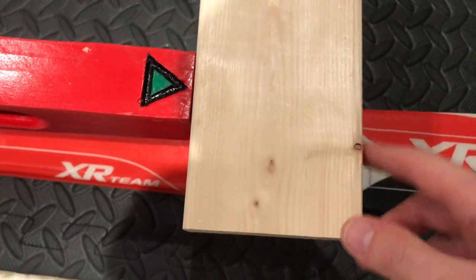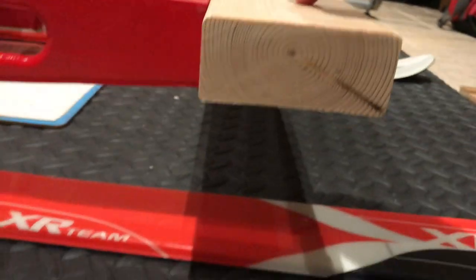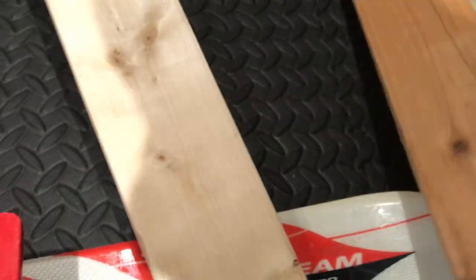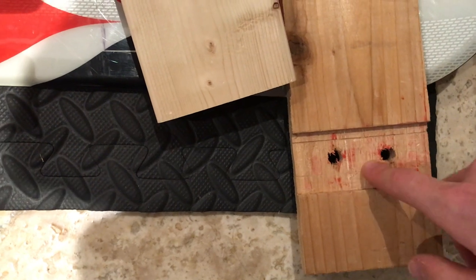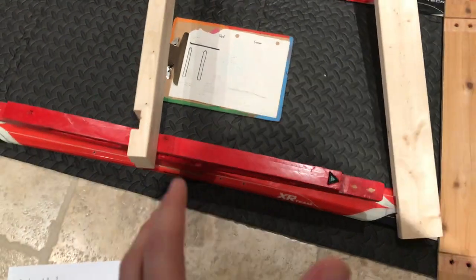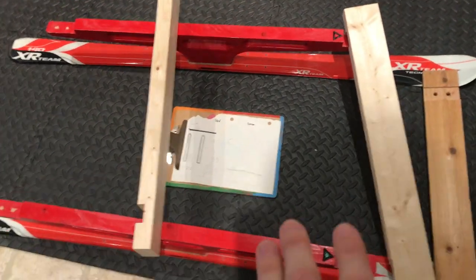A note of reference: if you're going to do this, wait until the end to drill your hole — drill through both the stretcher and the bottom at the same time so your holes line up. One of the problems I had was drilling the dowels in and gluing them first, then drilling hopefully matching holes with measurements, but there's lots of inaccuracy and that's one of the reasons why they all snapped off. So as you can see, it's still kind of in the prototyping stage. Version 1.0 is good, but version 2.0 will be even better.